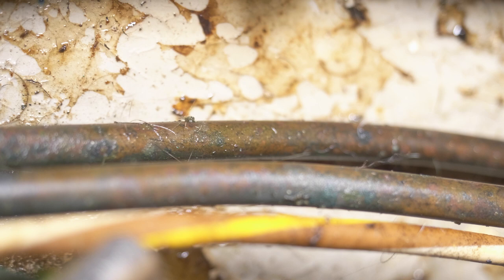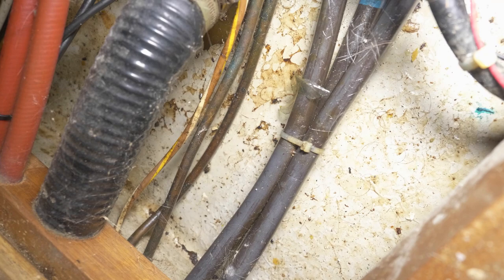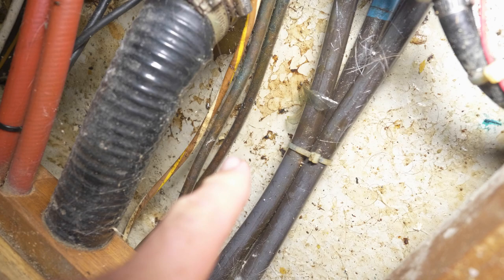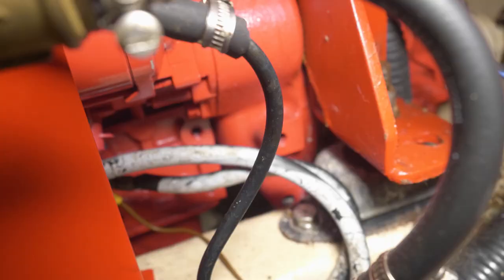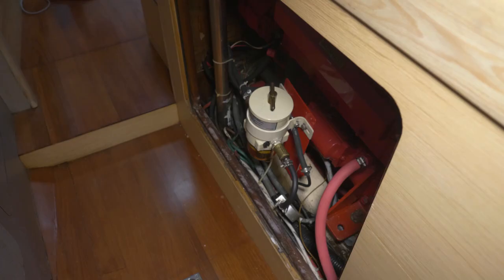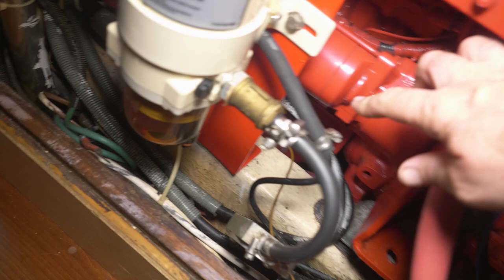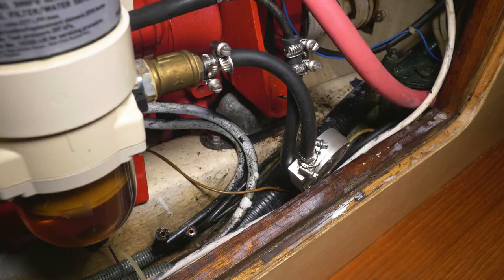I've already replaced this once in another area. What tends to happen is this pipe is lying on the floor — it is fixed in place so it can't move too much — but over 30 years it has started to leak. What I'm doing is replacing it, not with more copper pipe but with rubber hose, which is pretty much the same as this stuff here. We've got some new rubber hose, and there's the return pipe which is the old copper pipe. I'll just cut this somewhere down there to feed into the new pipe and then just run hose.